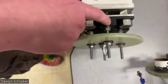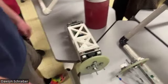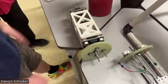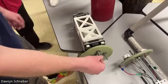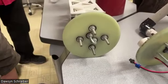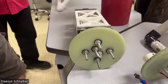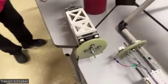Those aren't really doing any structural load bearing. It's all just the aluminum backing plates. The end caps are there to fill out the form factor and keep it a box. And it gets retained with these little threaded rods on either end. They're not really considered part of the payload, so they'll get removed for weigh-in and such, but they do intrude through to mount everything together. It definitely looks like that's not going to go anywhere.